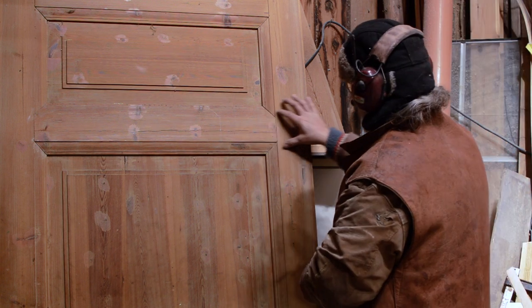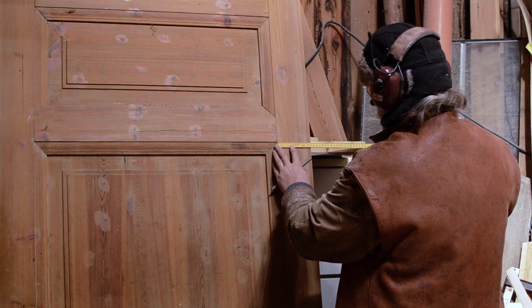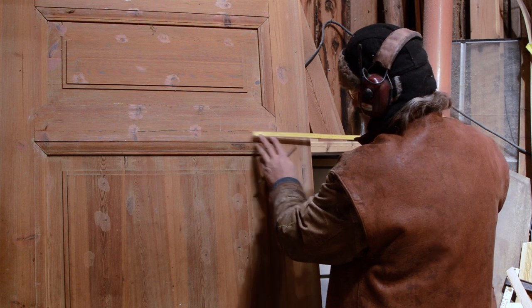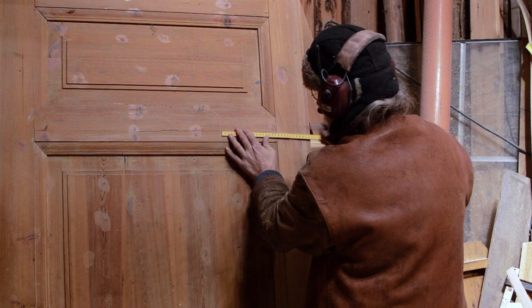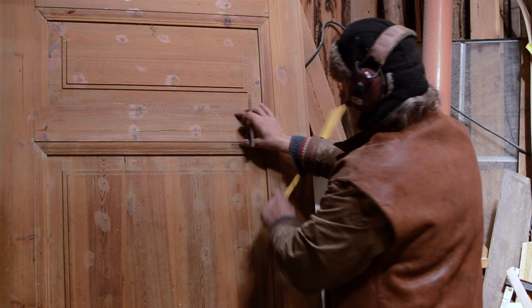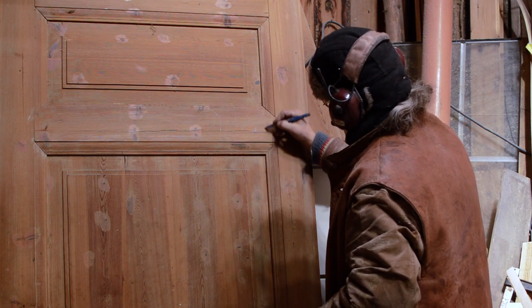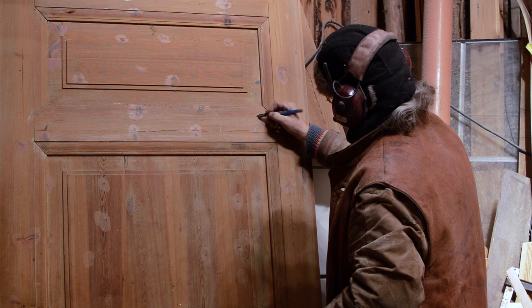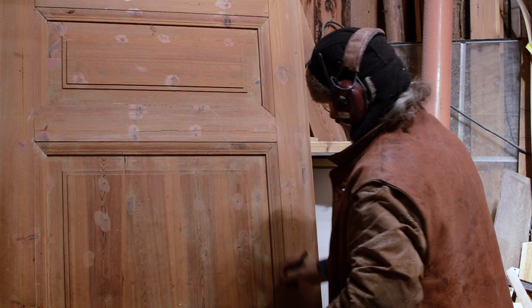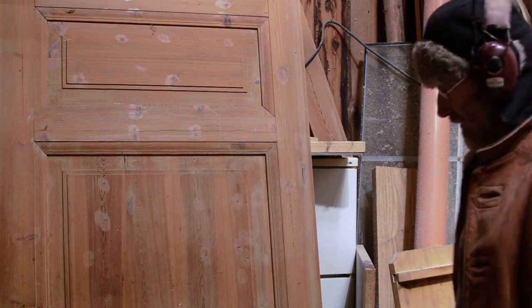See, this is mortised all the way through. There's a tenon that goes right the way out to the outside edge, so it has to be 11 centimetres. So you see, I'm going to use that wood there for the tenon, so that the bit that's wasted is only this bit. This is the bit where I can cut that little channel there. There's no harm in cutting there, so it doesn't have to be neat. I'm just going to use a circle saw to do that.